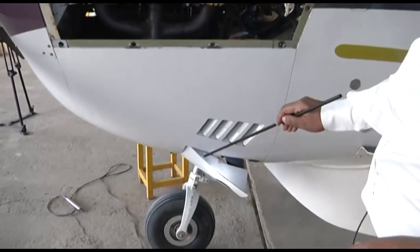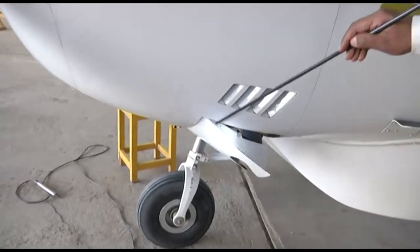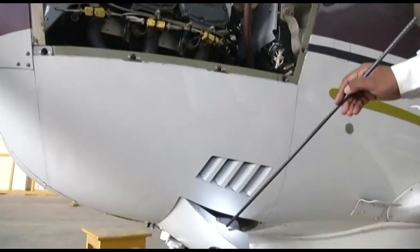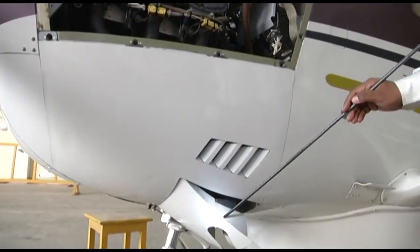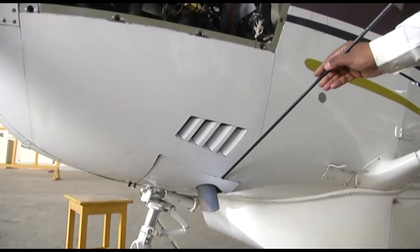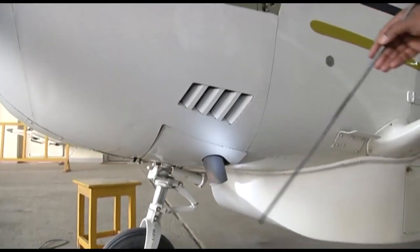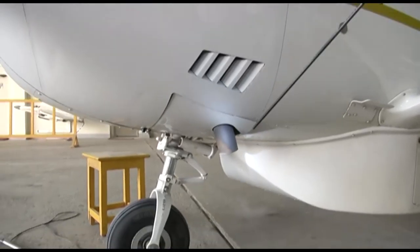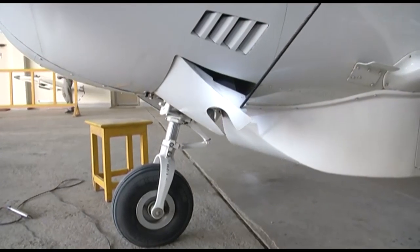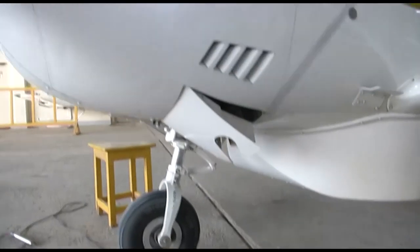openings. They are the cowl flaps, and this helps in moving the air out of the system. This flap is operated from a control in the cockpit. You can see this flap being operated. Now this is flush. We have seen in our slides on what occasions we can open the flaps and on what occasions we can close it, but these flaps can be opened and closed in different kinds of operations. So the air is ejected out of these openings, out from the cowling.